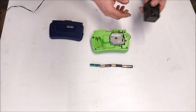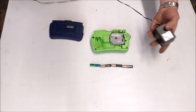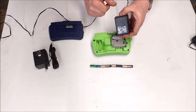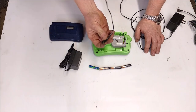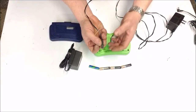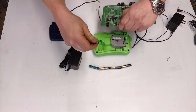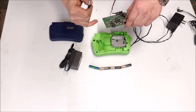So how am I going to power it? A transformer — a wall wart. These come in a bunch of different sizes and configurations. I found one that is 6 volts. On the other end, we have a DC power plug — it uses a little pin in the middle and the outside. The most common size is a 2.1 millimeter pin with a 5.5 millimeter outer.